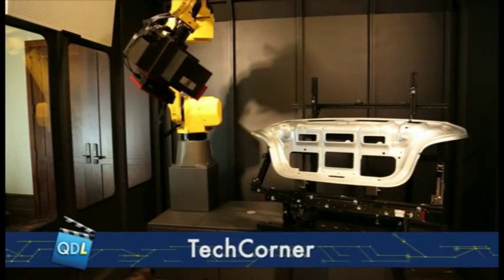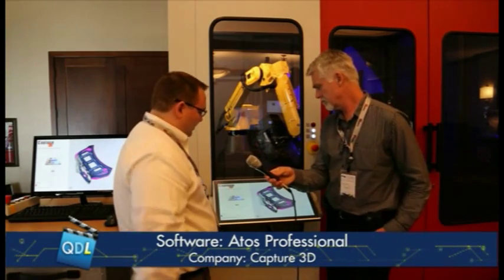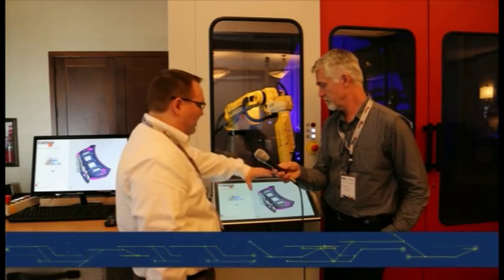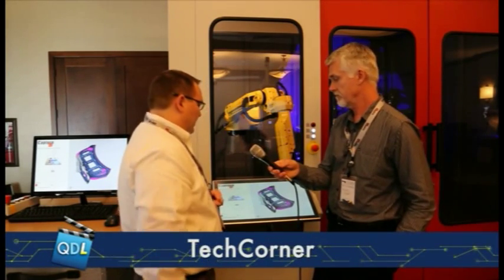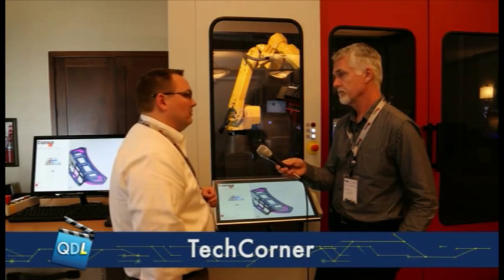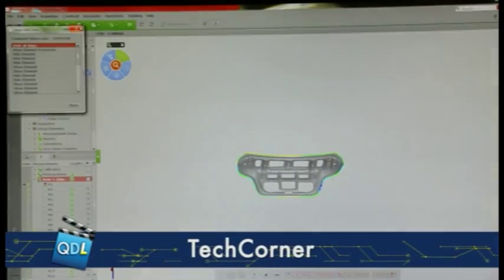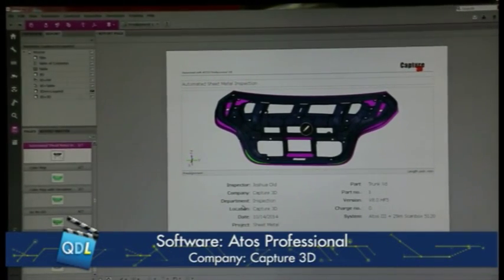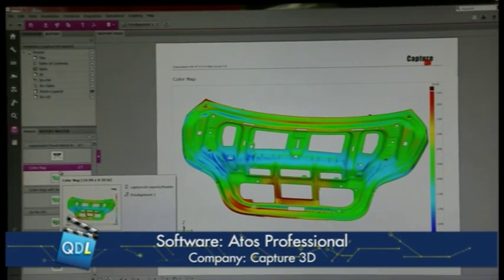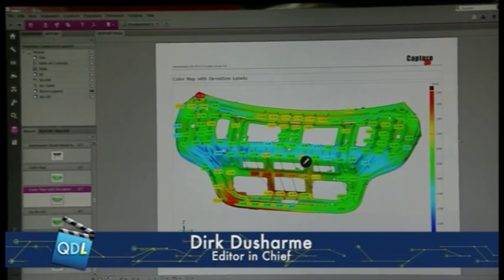Now it's scanning the part. What you're looking at is the actual collection of surface data, and on the screen you'll start to see the data being collected. The part itself is going to rotate with the part and the reel — this is an actual representation of how the part is sitting. You can have anything on the screen that you want, and you can customize it. Once it's done, it brings up whatever you want. Once you have the data collected, we can have multiple report pages showing different things — from title pages to surface profile color maps, plus and minus deviation. We can be very specific on where the deviation is and how far it is by adding deviation labels.